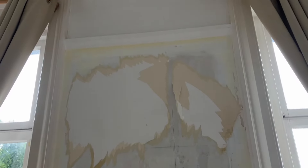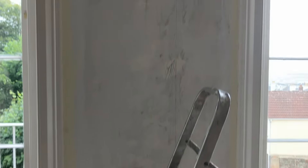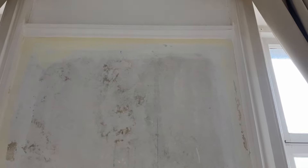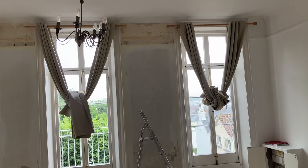I've left the dry bits on the floor so the wet bits are laying on the dry bits — I'll give that a clean up in a minute. I'll just finish off getting the rest of them off. That's that stripped up to the picture — that wasn't too bad. The reason I'm stripping it is because if you're gluing the boards on using the drywall adhesive and you can't glue it to wallpaper — wallpaper will just peel off and the boards will come down. That's why I'm taking the wallpaper off.